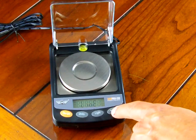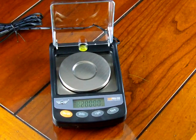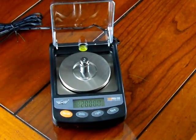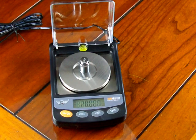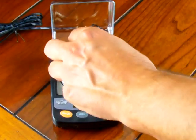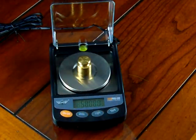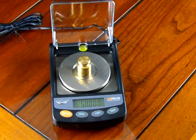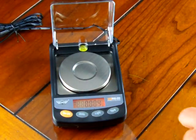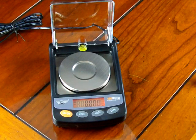We're going to store the value by hitting the tare key. The scale flashes 00 and then 20. We put 20 grams on the balance, then you'll notice the display switches to 50. The 50 gram calibration weight does not come with the scale — you'd have to find your own, though we do sell them. Here I'm using a brass 50 gram weight. You'll notice the display now shows 49.999, which is within tolerance. This is how you do the calibration of the GemPro 250.